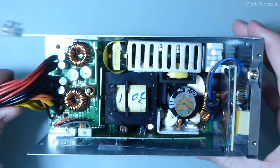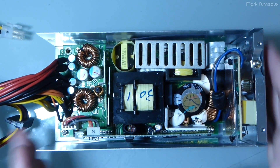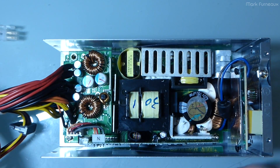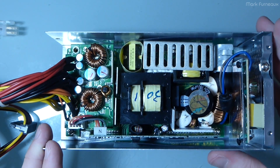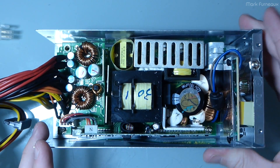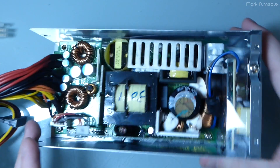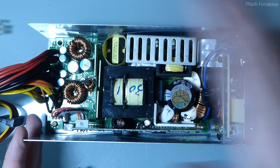Anyway, I don't want to ramble on too long. That's all I really have to say about this — it's a decent supply, it's not perfect, but it's better than what I've seen out there. I'd definitely put this in a lot of low power machines, and since everything from Intel nowadays is very low power, this works really well. The machine this is powering is a mini-ITX board with an Intel Pentium for an embedded system. The housing it has to go in is very thin, and I didn't want to put in a server supply because those have tiny fans that are loud. With this supply the fan never comes on, so it's much quieter. Hopefully that was informative — thanks for watching.